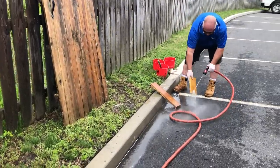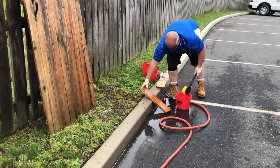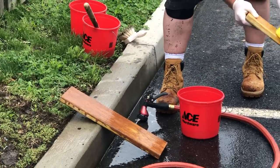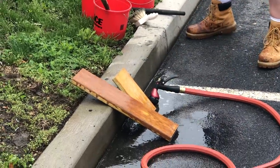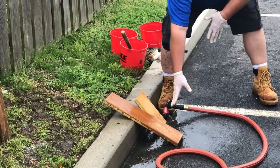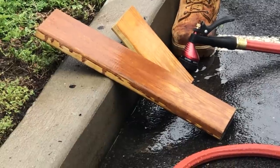See, this is how it's stripped off the end. Same thing with the brightener. So when you get done, this is what it should look like, okay? You have your stain over here, you stripped it off, it's back to the natural grain. It should look like that after it's brightened. You could sit there and say, okay, well, I still don't have that vision of what it's going to look like when it's dry. When you look out later, you're going to be amazed how this looks.